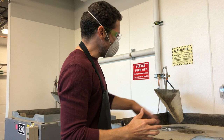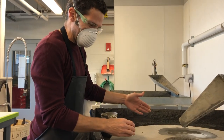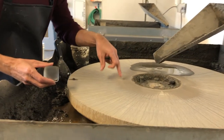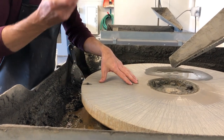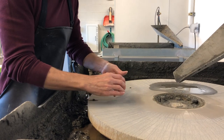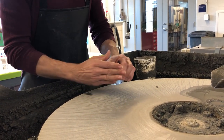So let's talk about how to use this safely. The wheel is spinning counterclockwise. I want to make sure that as I'm working I am holding the glass on this side so the wheel doesn't grab it and take it out of my hand. The other thing to realize is that it's the grit doing the grinding — the wheel itself is just a steel wheel with no grit embedded in it. What's actually grinding the glass is the grit running between the metal wheel and the hard surface of the glass. If I push down too hard I prevent grit from getting under the glass, and it won't grind. Also, if I push down too hard on a large surface it can suction onto the wheel and pull it out of my hand.